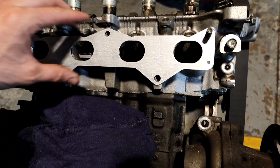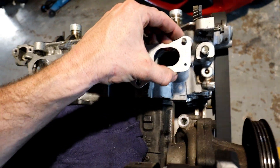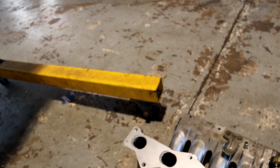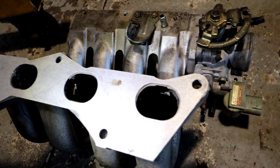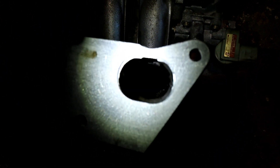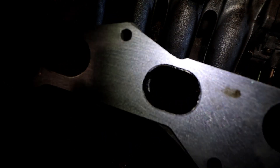There are a few different intake manifolds I want to run you through so you know what's going on here. We've got the 4E cylinder head and I've just got a laser cut plate here as reference for the gasket, and that fits perfectly on there and matches those holes. Now if we get this and sit it on a 4EFE manifold — on the outside you can see there's going to be a slight restriction, but the problem is on the inside. The runner actually tapers down about 15 millimeters in, so you're going to get a serious restriction there.